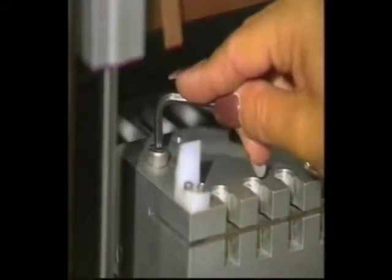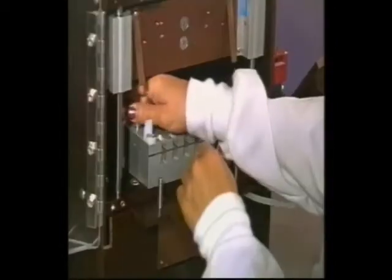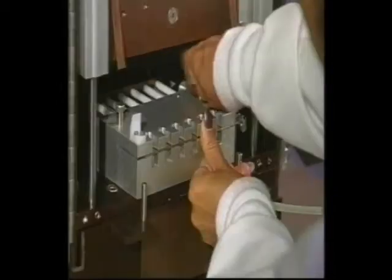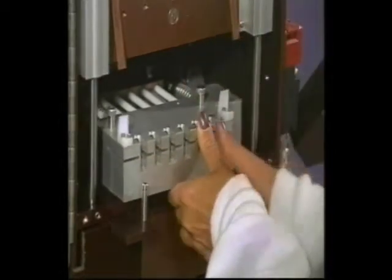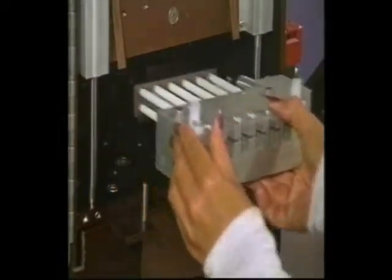To remove the rectifier block, reach in and pull the ejector rod bracket towards the front of the machine to release tension off of the shoulder bolts holding the block. Loosen the bolts and pull the block out gently. Some operators choose to do this step from the back of the machine.